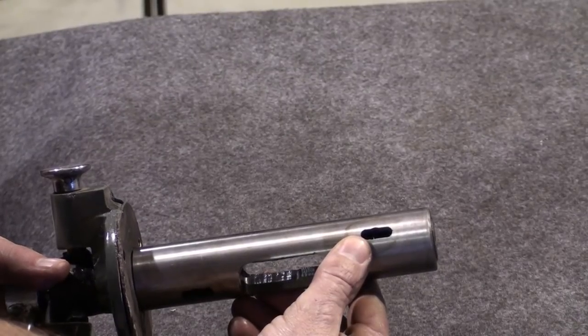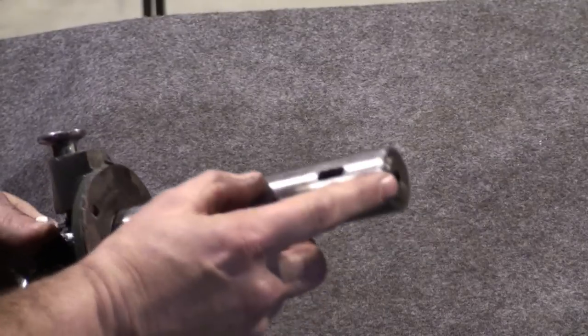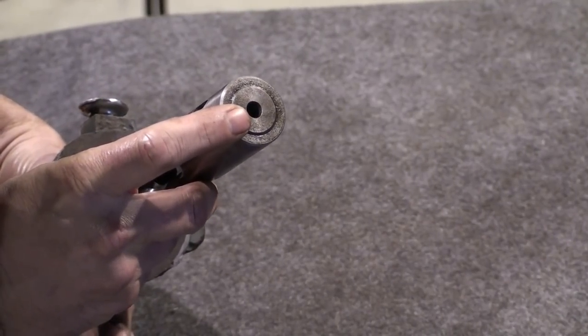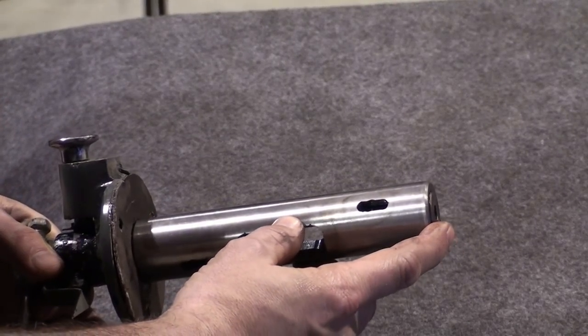This is the lower valve. When the hammer is in idling position, the lower valve has a supplement valve that delivers extra air that keeps the ram retracted into the cylinder. Let's take a closer look at this supplement valve.